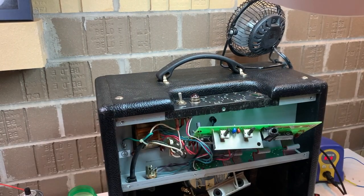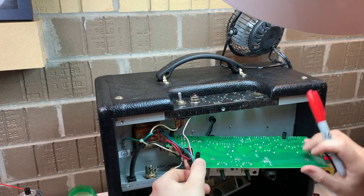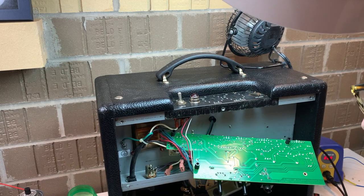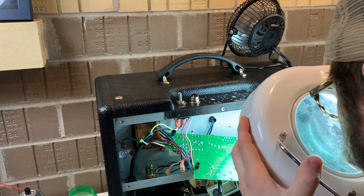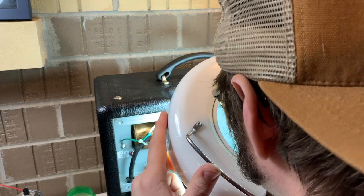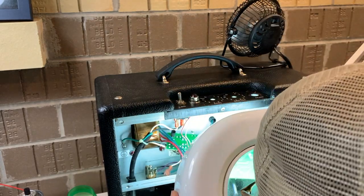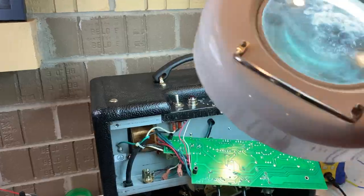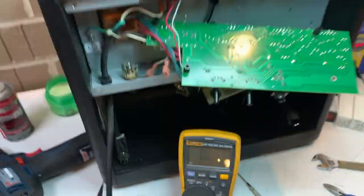You can see I'm marking one of the wires on the power switch and pulling two of them — when you pull two, mark one; that's pretty good. We're going to get a closer view with the mag lamp to look at some solder connections. How do the connections on the pots look? Those are what I'm most worried about on a Pro Junior, Blues Junior, Hot Rod Deluxe, or DeVille. Are there any burn marks? I'm going to re-solder those pots.